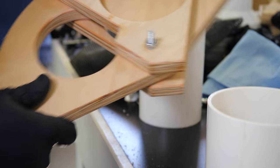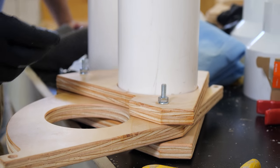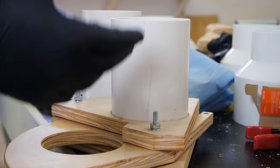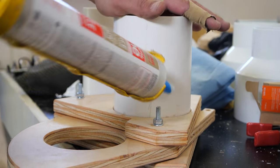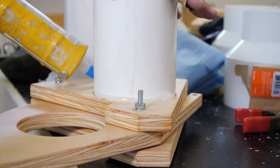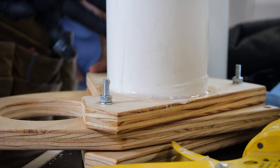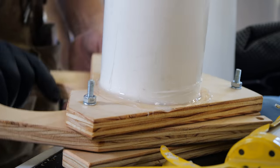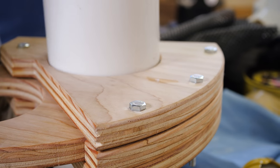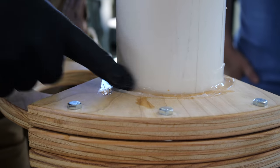When you're installing your pipes, you wanna make sure that your blast gate is closed. You're then gonna put whatever size pipe you want in there. For me, these are very short because when you're installing it in tools, you're around Ys and bends and everything like that. Having it closed is what's gonna seal up that gap. And then you're gonna put some clear or whatever color you want, silicone caulking, just making sure that there are absolutely no air gaps there. And then you wanna make sure you install your other side. So flip it over, you're gonna let the weight of it hold it down. You put in your other side here. And then once that dries, it can be installed and used, and it's good to go.